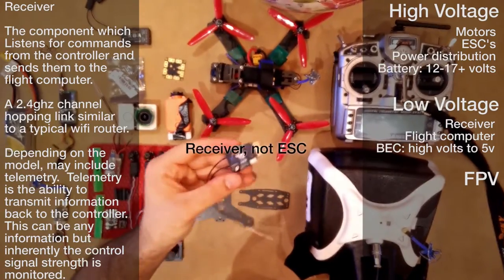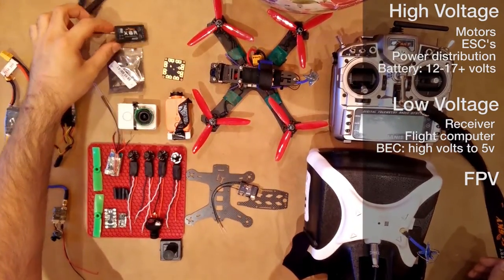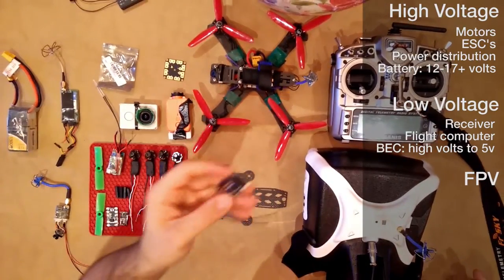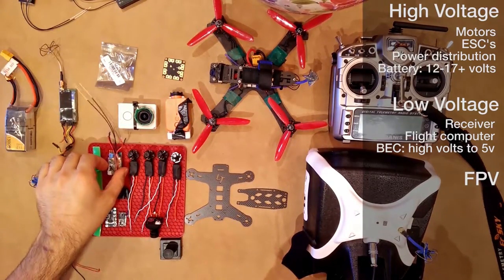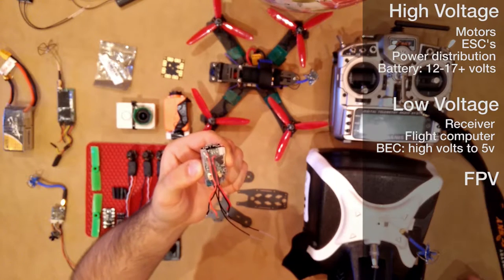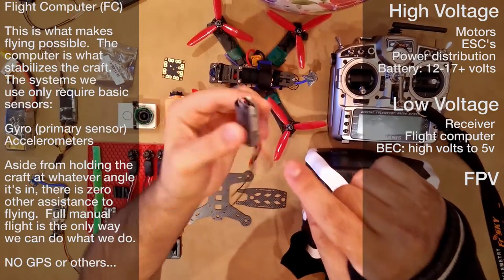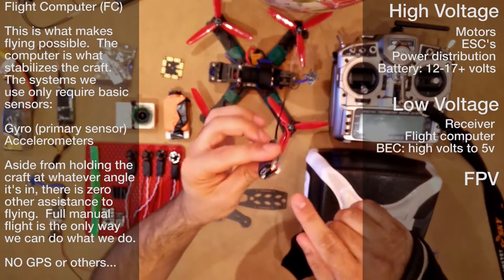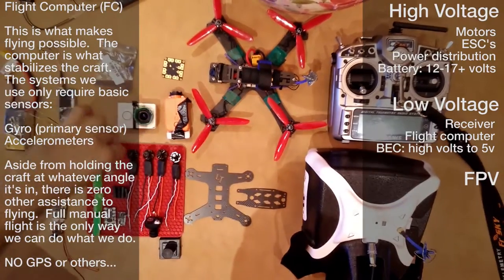This is what the receiver typically looks like. For the smaller craft, here's a more compact version — both are equally capable, but this one has more robust antennas and is just bigger. I've taken the smaller version down further: I removed the cardboard shell and the pins. So this is my entire low-voltage system for the smaller craft. The flight computer is actually the board underneath, and the receiver is the board on top — the two are tied together. I've removed everything off the receiver that I could and have just three wires soldered into it that go straight to the flight computer. The flight computer has four signal lines out, and that's all I need.